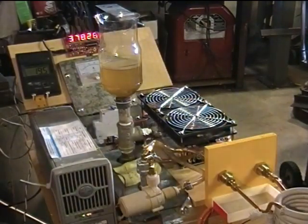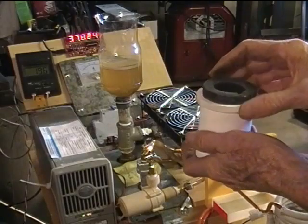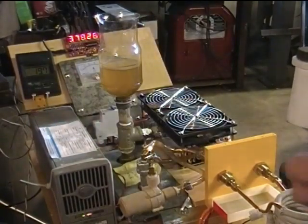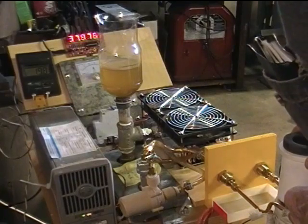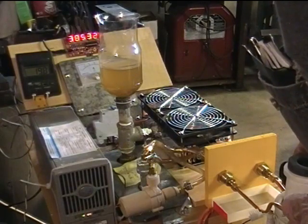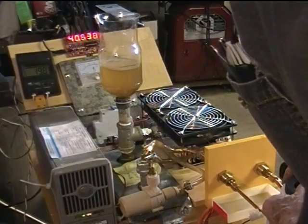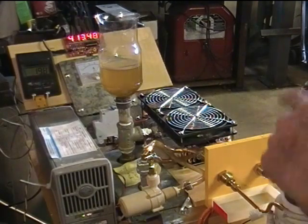Now we're going to switch to a crucible — an empty graphite crucible with a white ceramic outer shell. These work really nicely for melting non-ferrous metals. Water is now almost 20 degrees Celsius. Starting at 37.85 kilohertz at 6 amps: 10 amps 38.1, 15 amps 38.5, 20 amps 38.9, 35 amps 39.6, all the way up to about 40 amps — 41.2 kilohertz. So with an empty graphite crucible, frequency rises significantly with current.